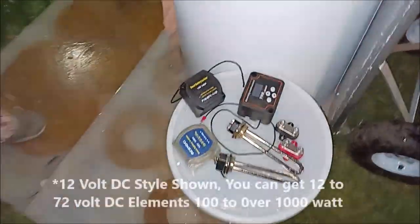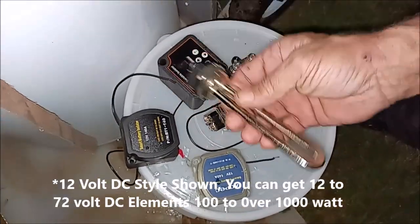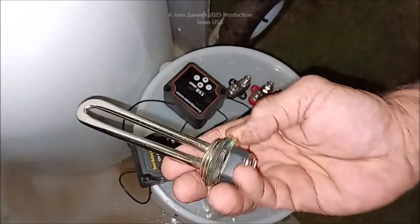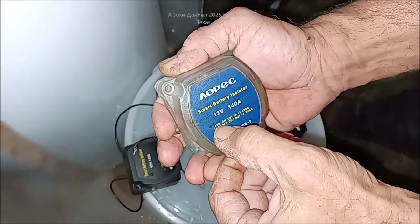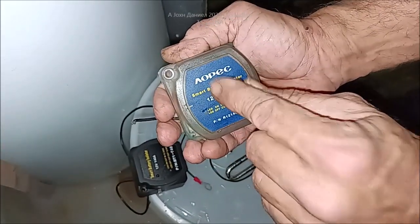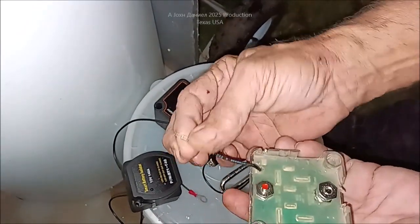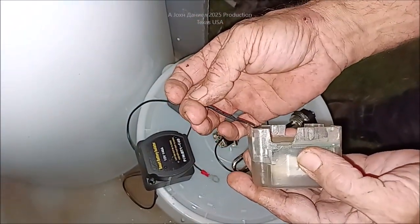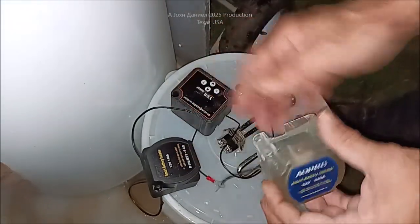Now, back over here to these items. These are the smaller ones — 600 watts. I'll put links to the 500, 600, and 700-watt ones. You can put two of these in this water heater. That is a one-inch standard fitting that goes into a water heater. When your voltage in your battery bank gets up past 13.3 volts — meaning your batteries are at 80% or higher — it will divert power. It sends your charge controllers up to a higher rate and sends the power to these elements. Using this accessory wire, we're going to connect it through the thermostats. The thermostat will allow power through when it's cold and kill power when it's hot, just like it would with a 240-volt element. We're going to be showing you that in the next video.